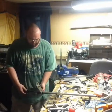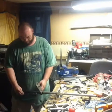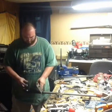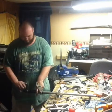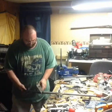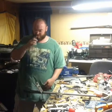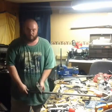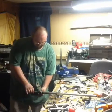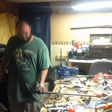And then you're just going to screw this until you feel resistance, to where it's like it butts up against it. Not tight, just a very little bit of resistance, because that's setting your head space. Alright, there's my resistance. Once I feel resistance, I'm going to back off a quarter of a turn, and I'm going to use my fingers right here to just kind of very gently go until I hit it again. Alright, there we go. I hit it again. That's where I'm going to lock it down.